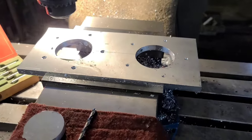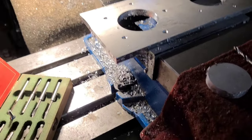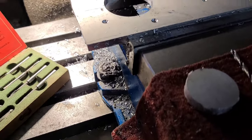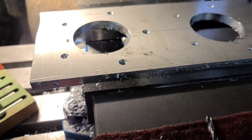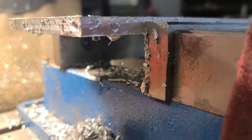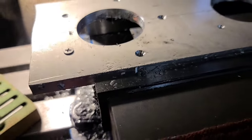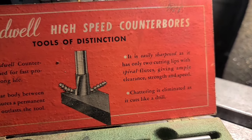Okay, I'm going to catch y'all up. It's about 5:15. I've got to go get the boy here at 6 and meet the host. I have to put those countersinks in there for these guys and calculate a depth where obviously they're not going to stick out the top — but we want to figure out how much they're going to stick out the bottom. For cutting something like this you can't use a regular one of these — it goes too deep, the chamfer gets too big.